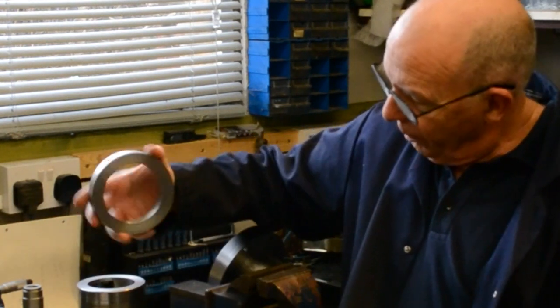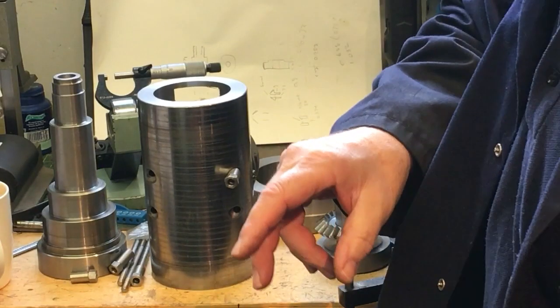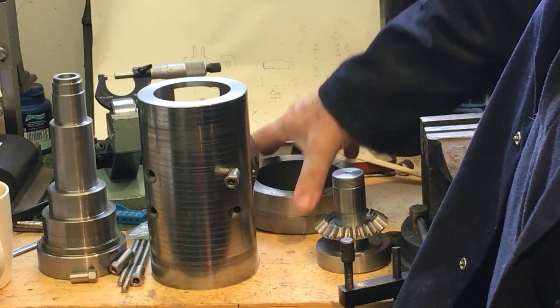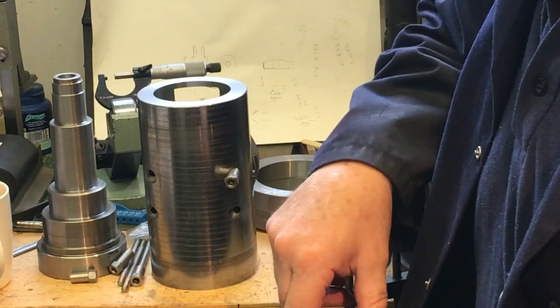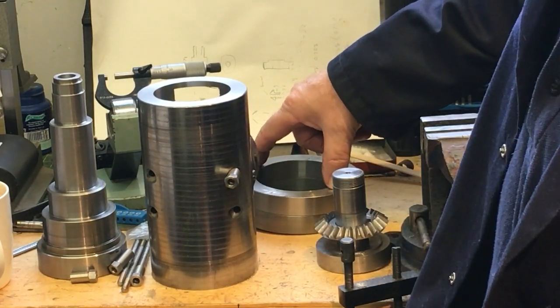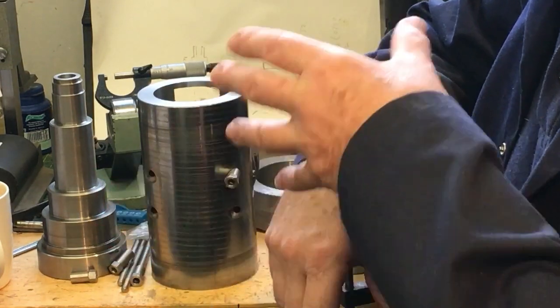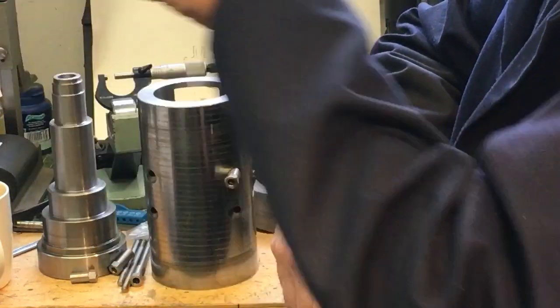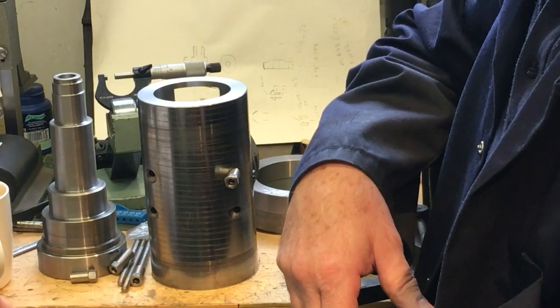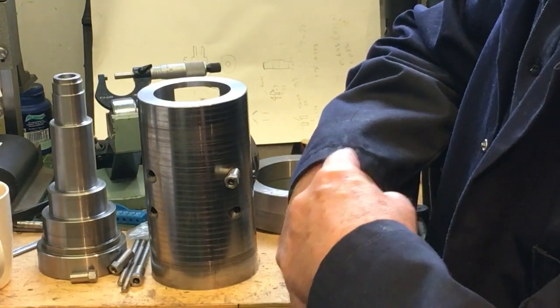These two rings: one will be welded to the front of the horizontal back plate, and the other will be welded to the body of the horizontal section. They will be drilled and tapped so that I can rotate the head between vertical and 45 degrees in one direction, or all the way round to 90 degrees. That will enable me to have a horizontal spindle running in the other orientation along the main axis of the bed, so I can take cuts along there under power.